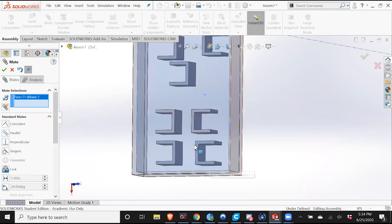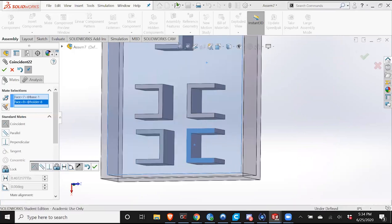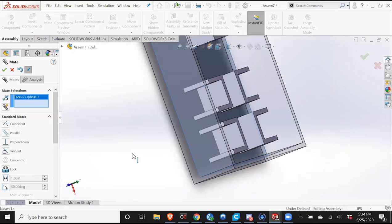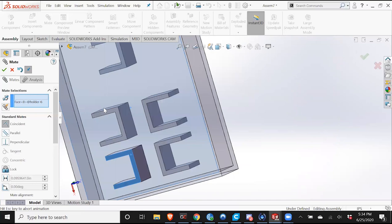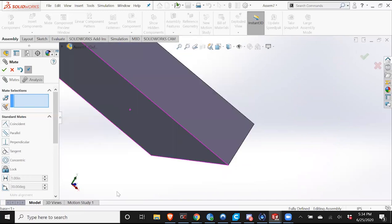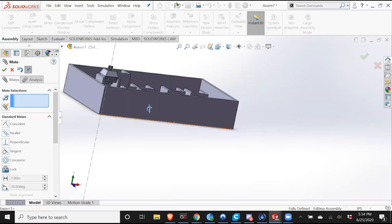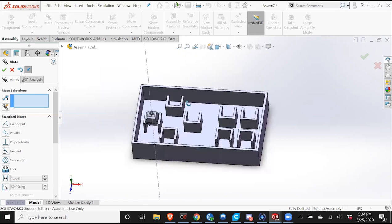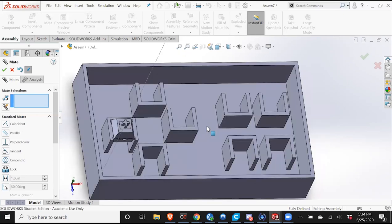Another thing to be aware of when 3D printing is that if you can, you should avoid steep overhangs, because then it will either print poorly or it will print with supports and require more material than it otherwise would need. But we're not really going to run into that issue on this project.